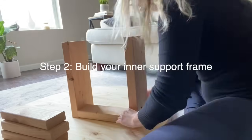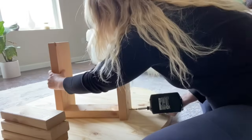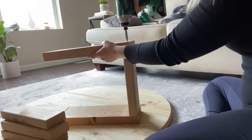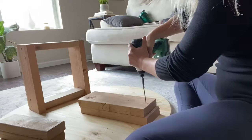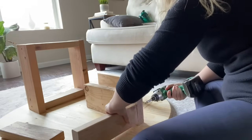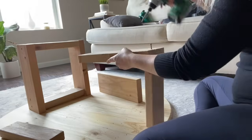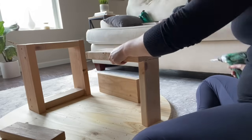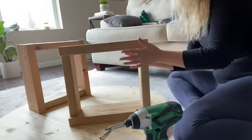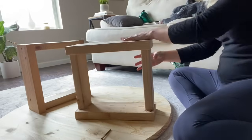Next, you're going to make a brace for your coffee table top and bottom. Take your two by four board and cut it down to your dimension. My entire coffee table is 17 inches tall, but I only wanted the boards to be 15 inches cut — I took 17 minus two inches to account for the depth of the top and bottom rounds. Then I used some deck screws about three inches long and attached all of my boards together. It was a pretty simple frame, so don't put too much thought into it. Just make sure you get your height correct.